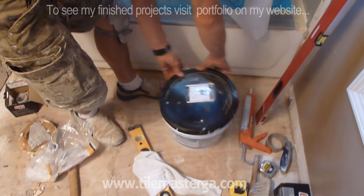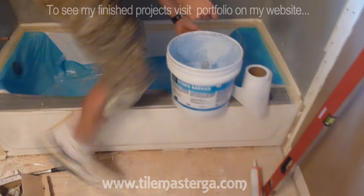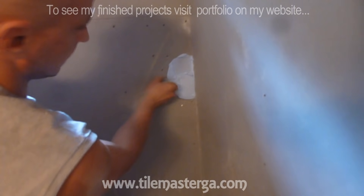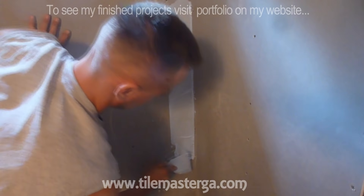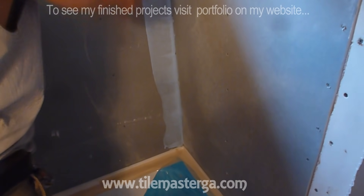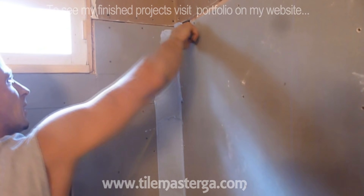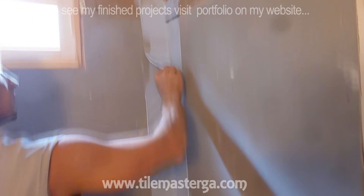I'm opening the bucket and using a sample tool to apply it. I'm starting from the corners — squeezing the membrane into the corner gap where the boards meet. Sometimes this gap is bigger; in this case it's pretty tight, so I'm squeezing as much as I can into the gap, applying the membrane first. It will go a little bit higher in the corner to overlap on top of our transition.